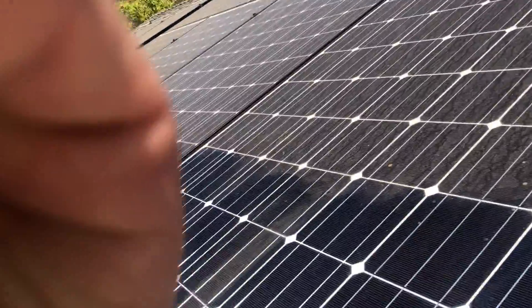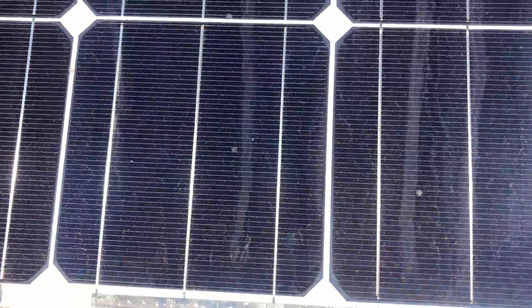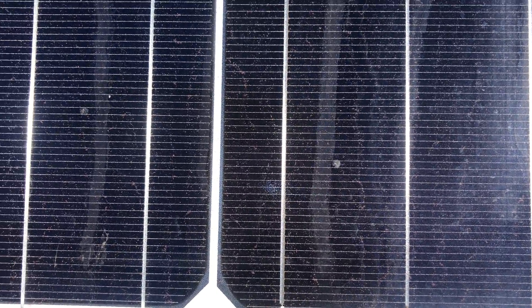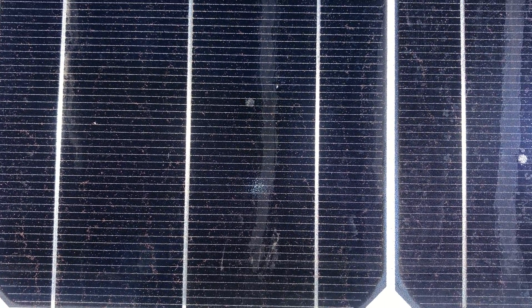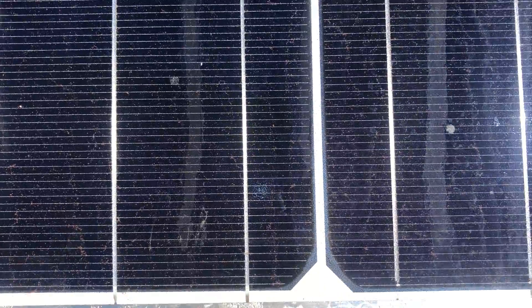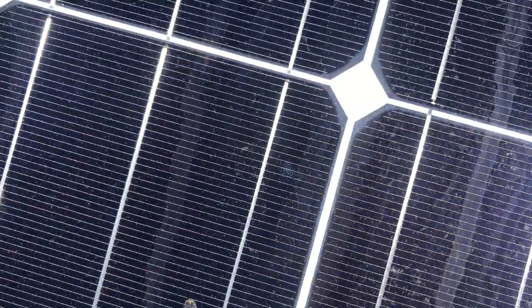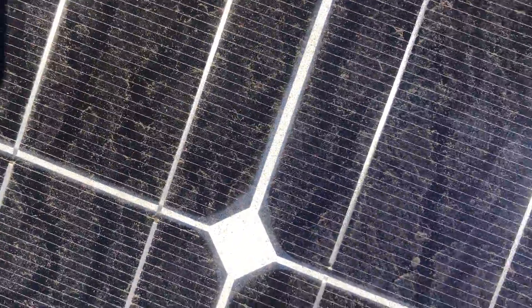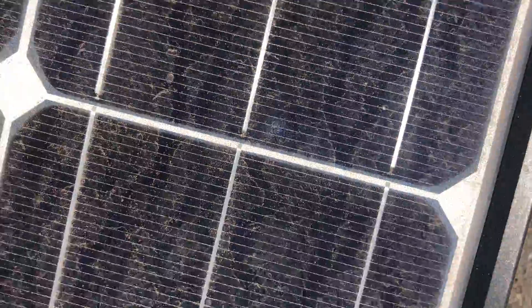So let's bring the camera in here. When we look at the module, you can see a faint blue reflection — that's the reflection of the camera's LED back into the lens. As we scan around, you'll see blue reflection from most of the locations on the module. We can even go up to where I haven't cleaned the module and you can see that we still see the blue reflection.